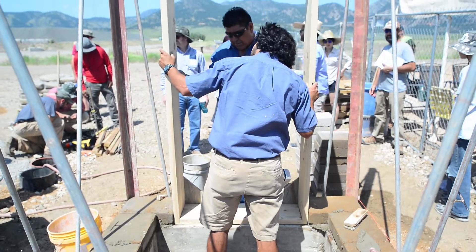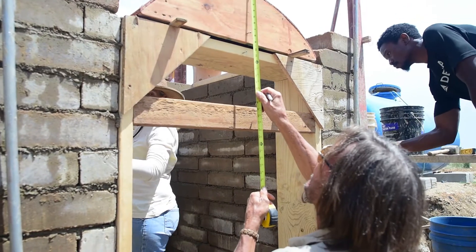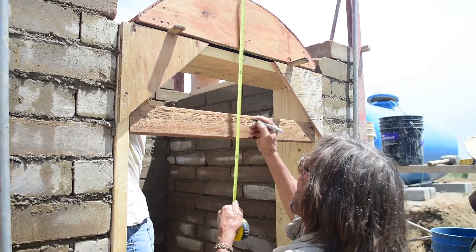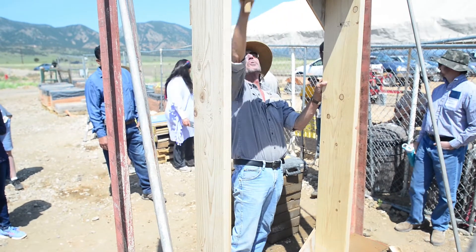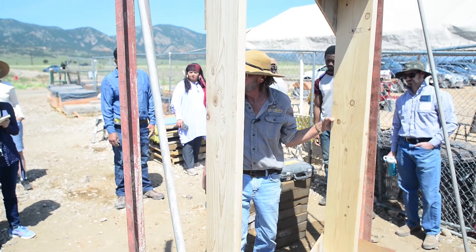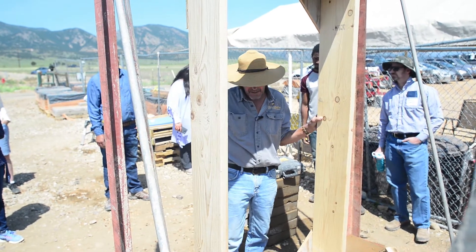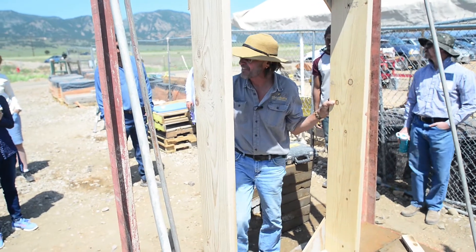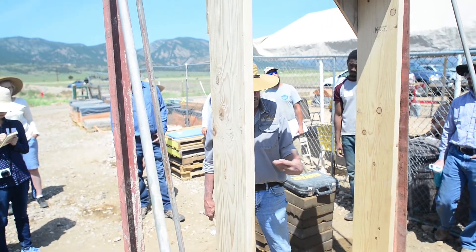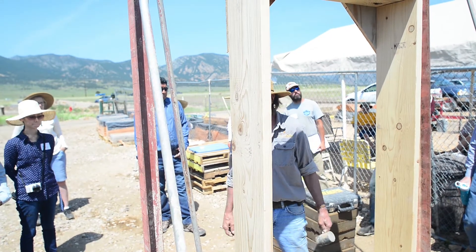This buck's a little different than most. When we get up there with the blocks, we're going to take this top piece off because we're going to put an arch over the door. We'll have a little arch form — the little one is for this door, the big one's for the roof. We'll take out the horizontal bottom piece too, probably, and put some kind of threshold there depending on where we end up inside. The idea is to end up inside flush with the top of the concrete with our earthen floor. We're just going to use earth blocks for the floor — why not? We have to have it in before the toilet parts go in, so we'll be doing that soon.